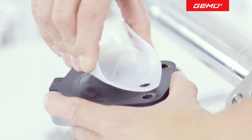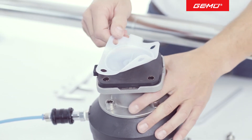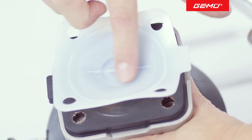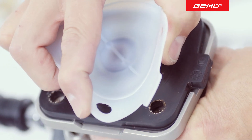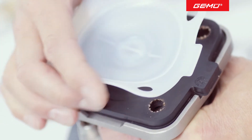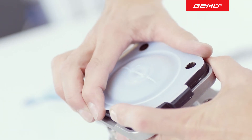At the same time, a dark ring forms in the center of the PTFE face. This means that contact has been made with the diaphragm back. Once this position has been reached, the PTFE face must be rotated backwards until its hole pattern is aligned with that on the diaphragm backing. The PTFE face is then re-inverted. Assembly of the diaphragm is now complete.